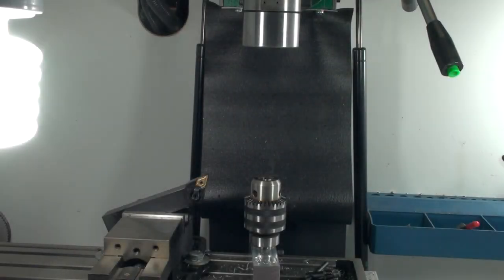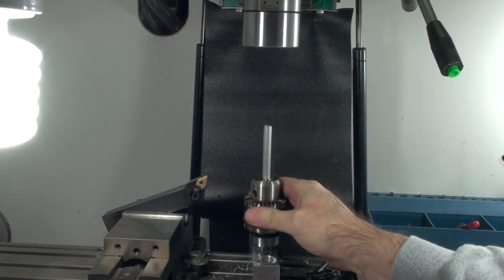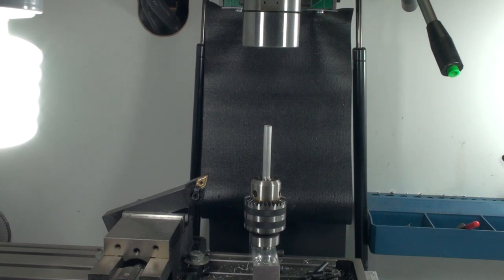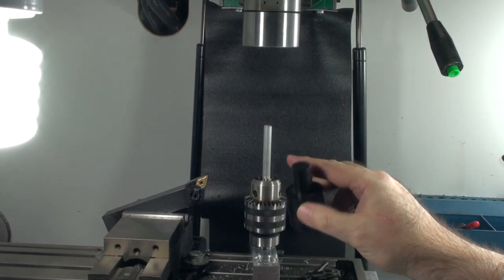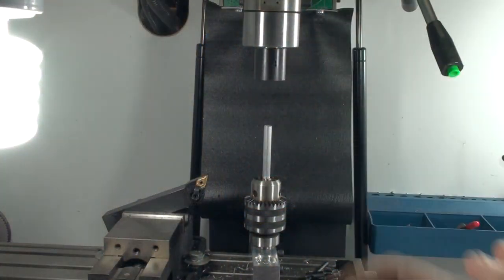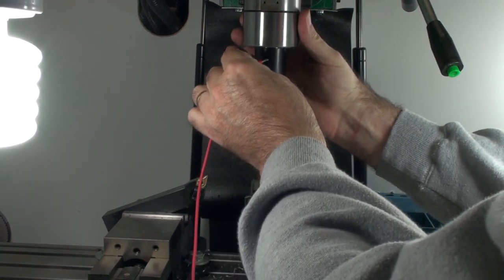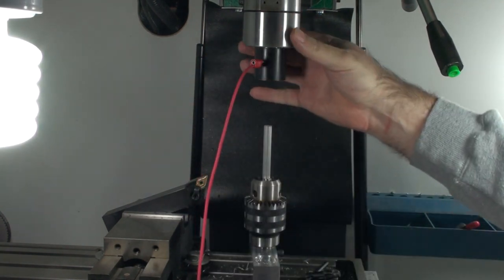We start out by mounting the drill chuck on the mill table and put in a round rod that goes straight up. Then we mount a tool made out of a copper pipe cap mounted in a piece of Delrin that goes into the Tormach collet. We also run a wire back to the CNC controller electronics so that Mach3 can get a signal when the rod makes contact.